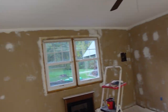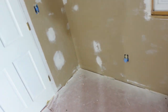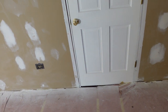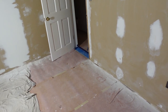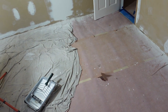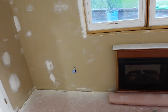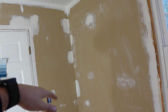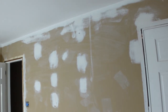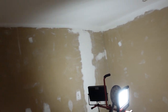In here we're ready for primer. I want to clean all the floors first just in case we roll something onto the floor — we don't want to get it full of compound. I'm going to clean up, patch some holes, do the best cleaning job I can, and get ready to put some primer on the walls. I've got one little spot to sand and touch up, but otherwise all the walls are wiped down and we're ready for Kilz primer.